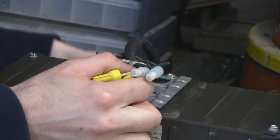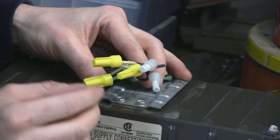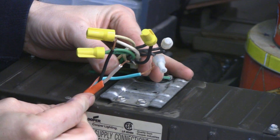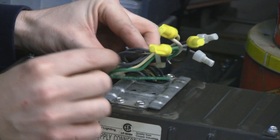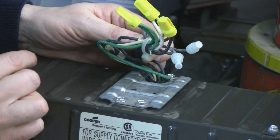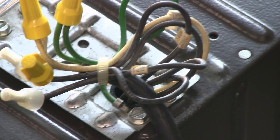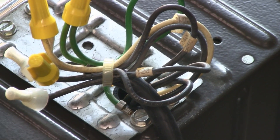I'm going to show you how to attach the new cord. As you can see, we have green wires, white wires, and black wires. We're going to attach the green and the white to the green and the white on the new extension cord, then pick out the correct black wire. Each black wire is labeled inside for what voltage you want — that's why they call it a multi-tap. The black wires are labeled: you can see there's a 120, which is the one we're going to use, and there's a 240. The one hooked up now is a 277.